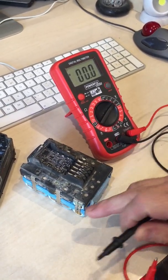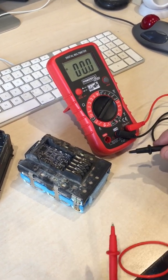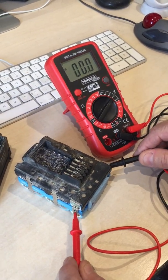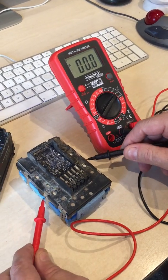On stripping it down, I found that this bank of batteries was reading just 1.6 volts, so I thought I'd found the problem. I've charged that bank to match the others — they're now all reading 3.8 volts, so they're all pretty much balanced. I think this one's about 4 volts and this one is 3.8.